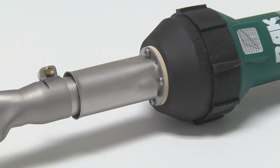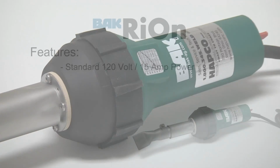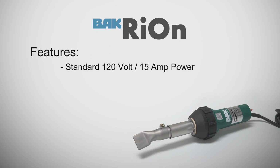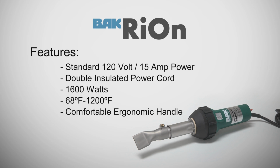This lightweight 120-volt hand tool weighs just 2.8 pounds and will run on any standard 120-volt, 15-amp outlet. It features a commercial-grade double-insulated power cord and a standard 2-prong plug. The RiOn hand welder uses 1600 watts of power and will reach temperatures between 68 to 1200 degrees. Its ergonomic handle design with the 2 flat sides allows for comfortable hand welding all day long.